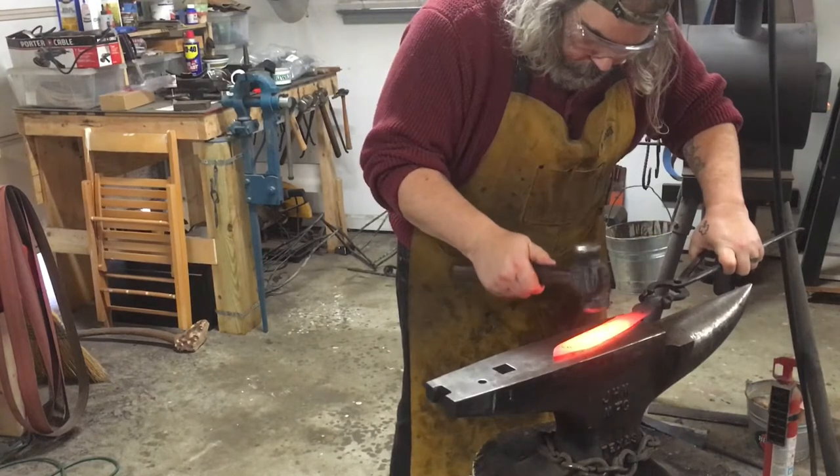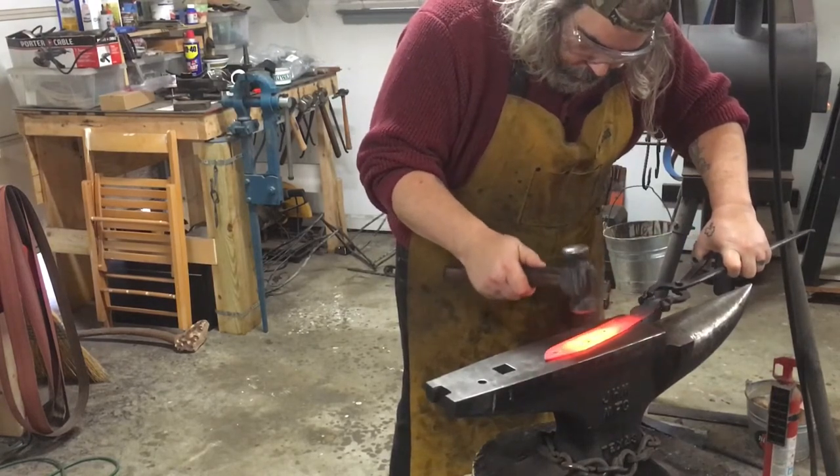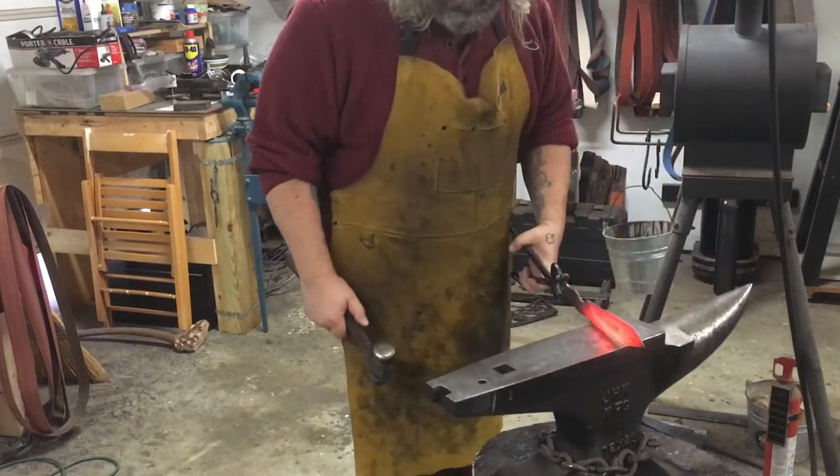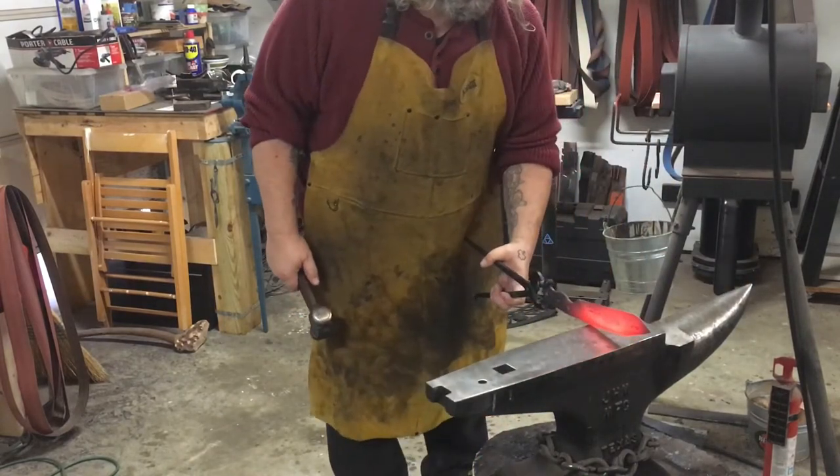This is the opportunity to get everything as straight as you can by eyeballing it. I'm also going to clean up the steel here as I get ready to start my three thermocycles, and I want to set myself up for success so I can immediately quench after the thermocycles.